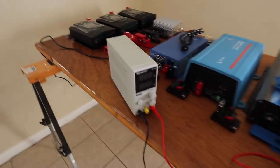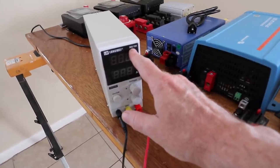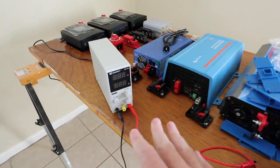The next step after you connect all of the lithium cells together is to get a DC power supply so that I'm able to top charge — get all of these topped off at a charge that's equal. Basically you want to raise them up from 3.2 or 3.28 where they're at now up to 3.65. There are lots of videos on how to do this — Will Prowse's videos are probably the most popular and that's what I've gone by. So you've got to buy one of these gizmos to bring it up. And that's basically how you do a top balance.